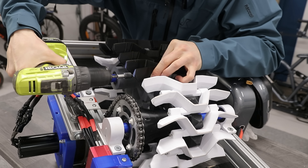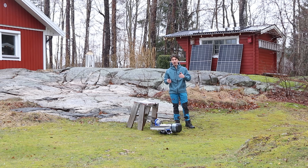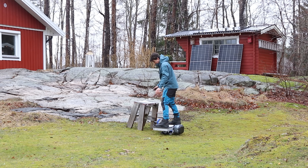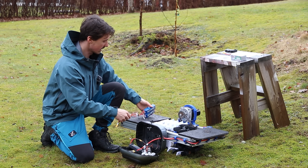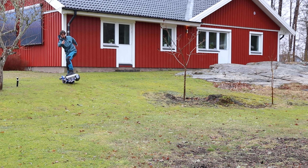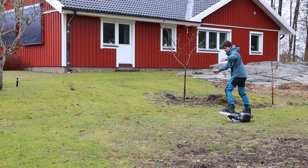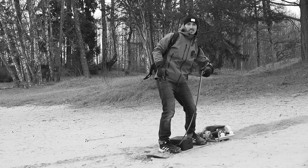I had to replace a few broken links once again, but decided to also lower the voltage, which provided much better control. We started at 48 volts, down to 24, now we're at 16 — I can't go any lower than this, this is gonna be the last shot, all to keep that initial torque as low as possible. Now it just doesn't have enough torque. I can't do it.